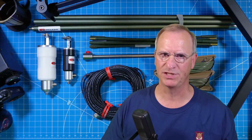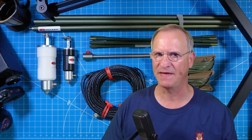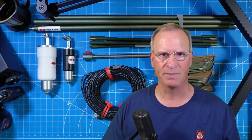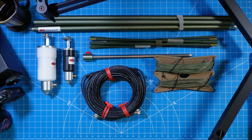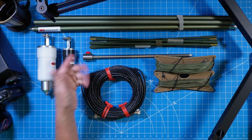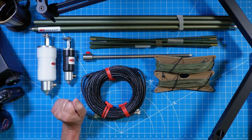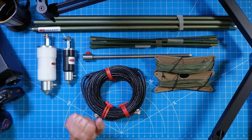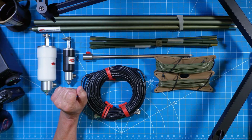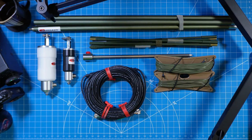The Chameleon EMPAS 2.0 is a versatile, high-performing, man-packable HF antenna designed and built upon a Lego block-style system, meaning it has a series of interchangeable components. This starts with the ground spike, then you choose either a CHA Hybrid Micro or Mini to go on top, followed by a military extension and a military whip. The combination gets you over 18 feet in the air. Attach your coax and a ground radial, and you're ready to operate.